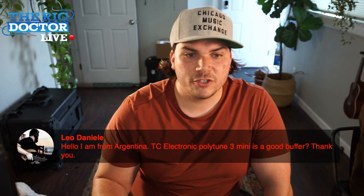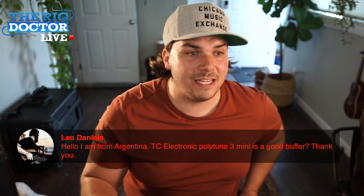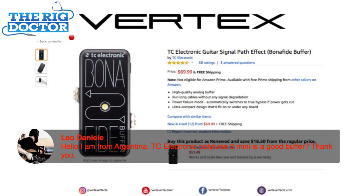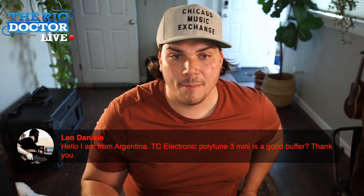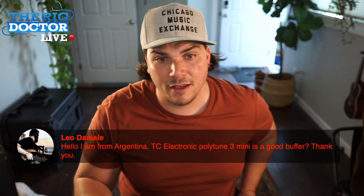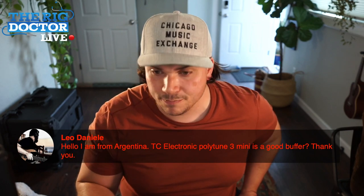This is a good question, actually. I'm from Argentina. TC Electronics Polytune 3 Mini is a good buffer. Yes, it is the exact same buffer as the Bonafide, as this one. So it has this built into it. That'll be fine as an input buffer. You would just want to get an output buffer for the very end of the signal path, driving from the last pedal going back to the amp, driving those cables.